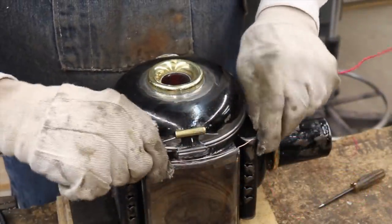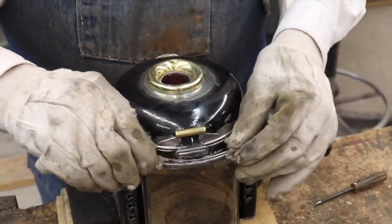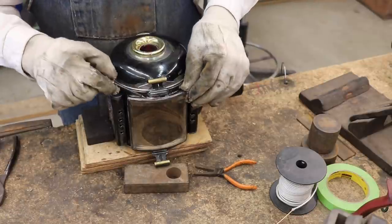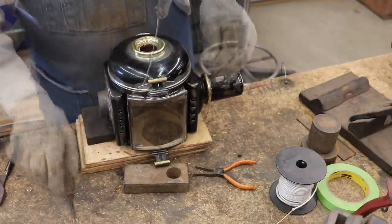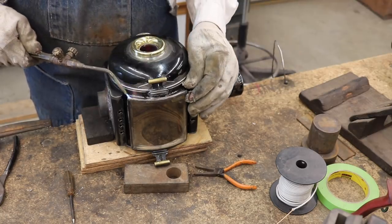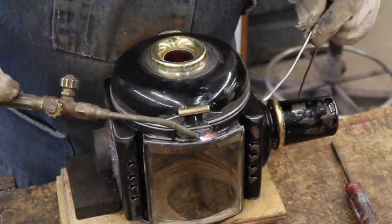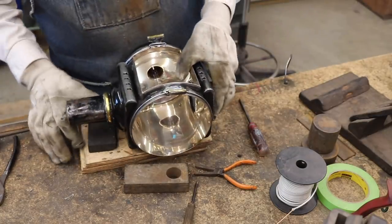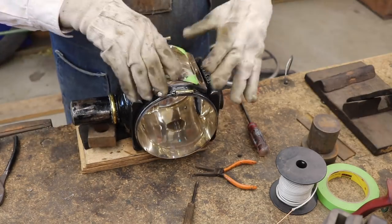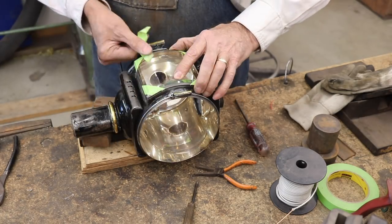These pieces of bent glass were not bent exactly true, and therefore there's a small gap on one end of each of these pieces. So I use a piece of copper wire to fill the gap. It makes a lot neater solder joint than just trying to gob a bunch of solder in there to fill it. And the side glass is put on the other lamp in a similar manner.